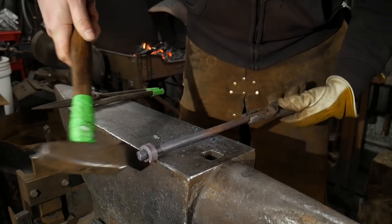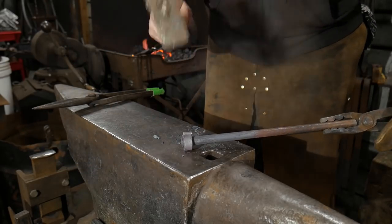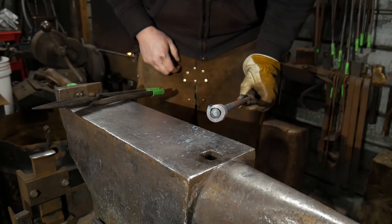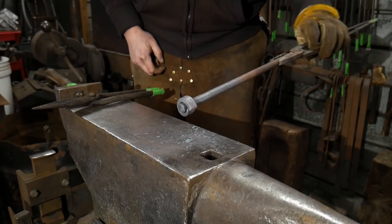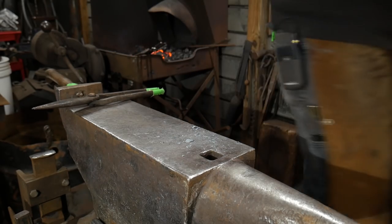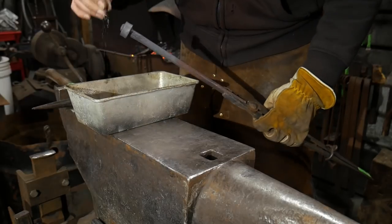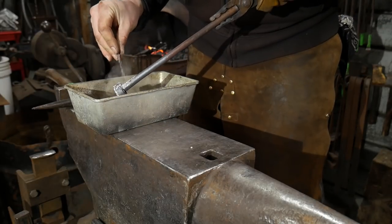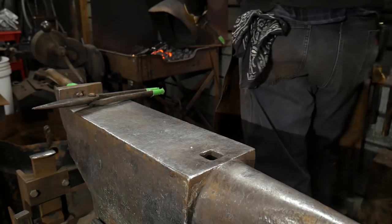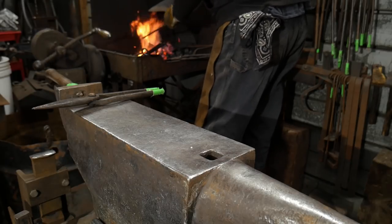We're going to drive that piece up further to where the collar needs to be — right on the end of that bar. If you hammer on it here it's just going to expand out on you, so you don't need to do that. You're going to see a little bit of gap — that's good, that's what you want. You want this to be able to flow together as we roll it and get it forge welded up. Because this will most likely trap flux or scale, we're going to put just a hair of flux right here on the end and at the beginning — that's all. Very light fluxing. Do not drown the piece; you will inhibit your weld if you drown the piece in flux.